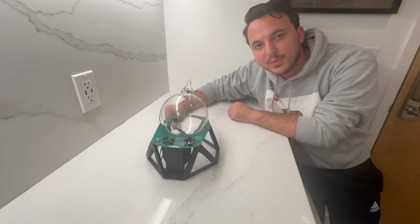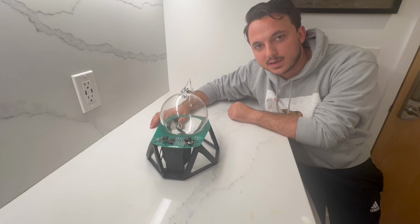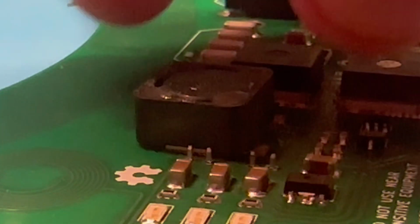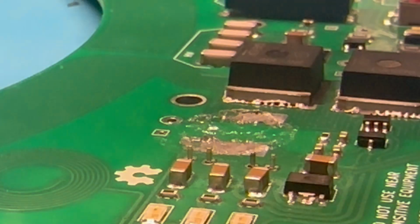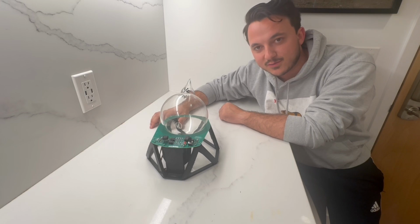And that does it for the build of the Plasma Toroid. I really appreciate all the effort that went into designing and documenting this project on hackaday.io. The page has lots of photos that I've referenced just to make sure I got things soldered in the right place. The biggest problem thus far was getting the L1 inductor soldered to the board. I had to add legs to it. I just wasn't confident that I was successfully soldering it, as you probably saw in the middle of the video.